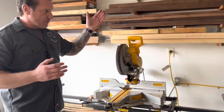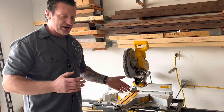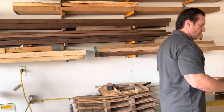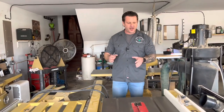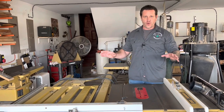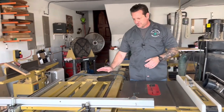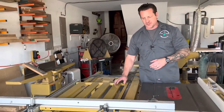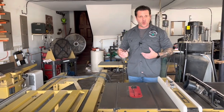Here I've got my first saw when I start my process — this is my compound miter saw from DeWalt. It's a great saw with good capacity to cut. If you've never had a compound miter saw, I highly recommend one versus a standard chop saw. Over here is where the milling process starts. I've got my Powermatic 2000B table saw — this is a five horsepower saw. This will cut through quarter white oak like it's balsa wood. Amazing motor, very well balanced, great saw. I also have the slider capacity so I can cut sheet goods — consider this like a very large crosscut jig, really nice for large sheets of plywood, especially in a one-man shop.